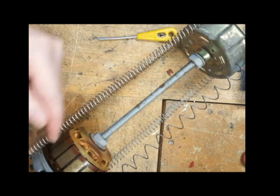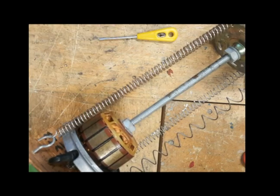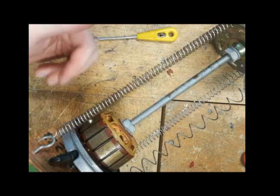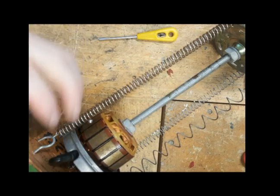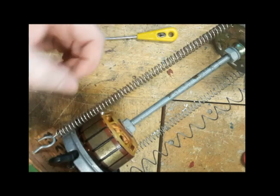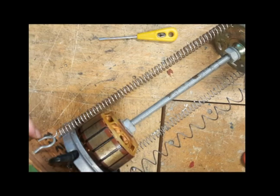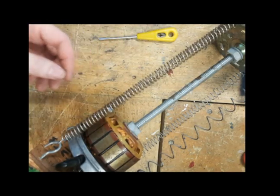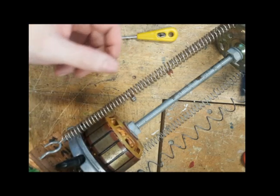So if I stroke the spring like this, you can't really hear it through the amplifier very well. If I place a tiny magnet right here — that magnet vibrating will create a magnetic fluctuation inside this coil, which makes all the electrons shift backwards and forwards to create the current. If I put the magnet there — the further away the magnet, the weaker the magnetic field in relation to the coil, and the quieter it will be.